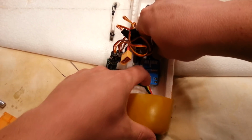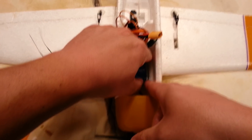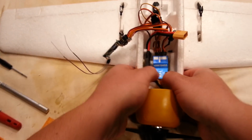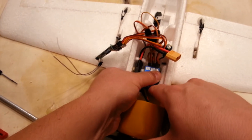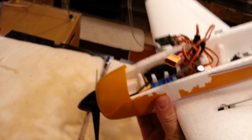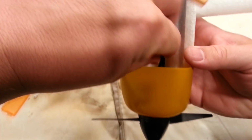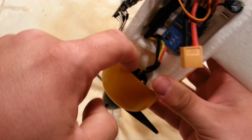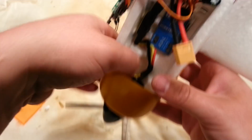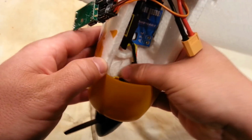Okay, so those wires are for the brushless motor, of course. And I'm going to redo this tape and all that. I've just got this little 3M tape on there still. I like it. The only thing I don't like is if I were to bump into that with the battery, there's a little setup button. I do not want to enter setup while I'm trying to fly. Okay, so we're going to have to do a little bit of protection around that. The other thing I don't like is having this wire capable of running into the brushless bell housing. Well, that's actually a motor mount down there, but I don't want them to be able to hit the prop shaft either. And we talked about that earlier, right at the beginning of the build, if I recall.